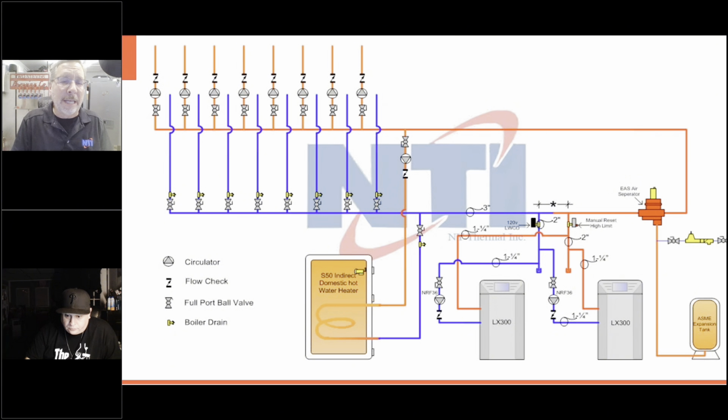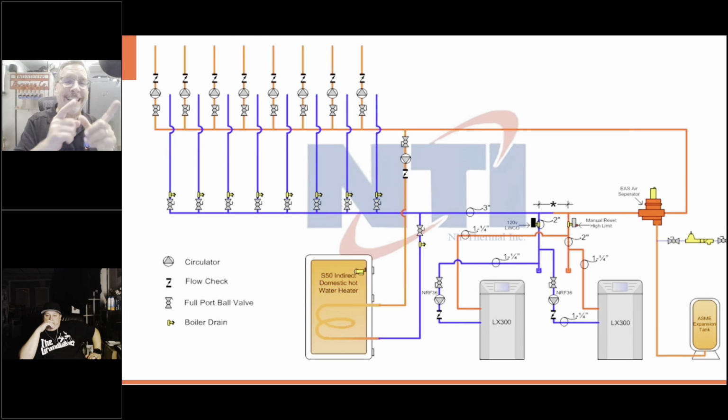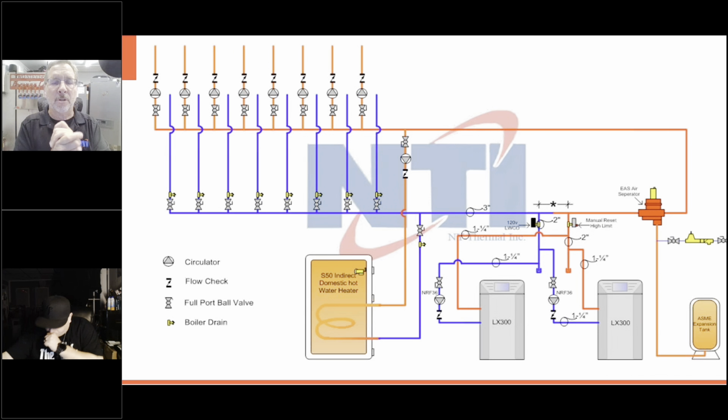So this satisfied the high amount of hot water we needed, turned off the zones using a relay and additional control on the boiler. We broke the ZC-ZR jumper so that it no longer had power. And when that came back on, we put the jumper back in ZC-ZR so that the circulators could run. If you're not sure what the ZC-ZR jumper is in zone relays, you'll see it next time you open it up. You'll see the jumper there.